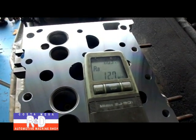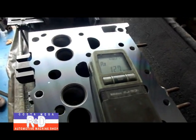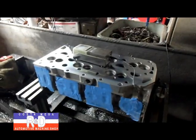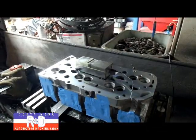As you can see, we've got 12.7, which is quite an improvement over what we had. The factory specifies at 20 or better, so I say that we've exceeded that quite a bit. If you have questions about cylinder head resurfacing, profilometers, or surface texture measurement, give me a call here at Coastal Mesa R&D. We'll see you soon.